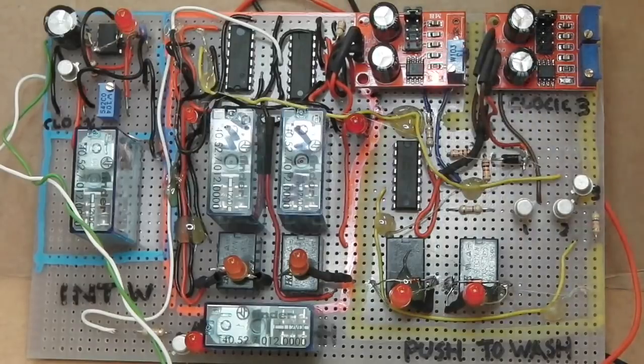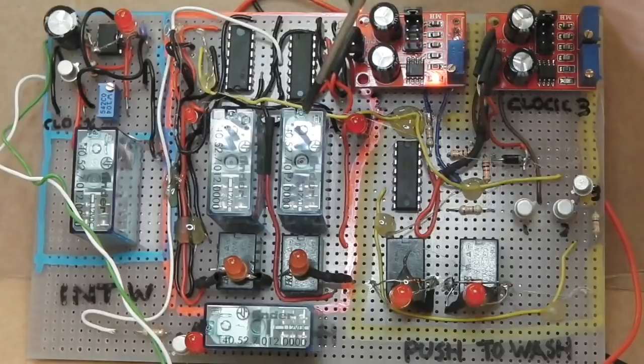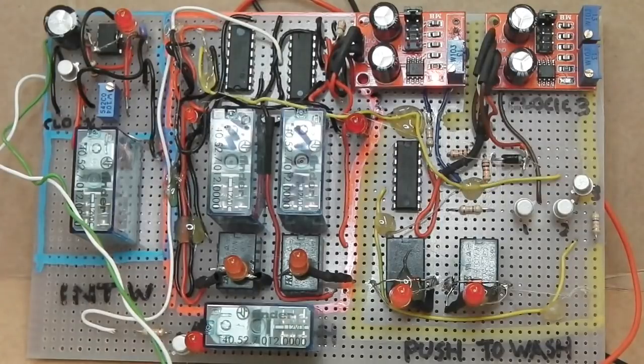The microchip can't push enough power out to switch a relay on, so whilst the microchip's happily clicking away with its little digits, it can't drive the relays that we want. It needs help from a transistor, which is again a miniature switch, which helps increase the power output.